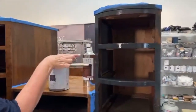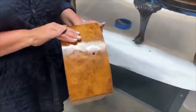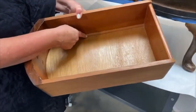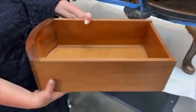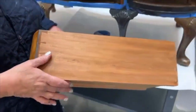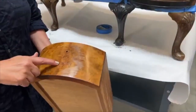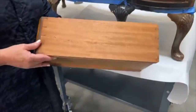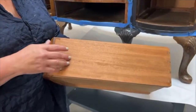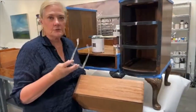Something I plan on doing — look at this. I'm going to leave my drawers like this. When you add these quarter-rounds inside a piece of furniture, this is a telltale sign that it was done by a craftsman. And I do have dovetail — this is mahogany. So I'm going to put some wood tonic on the sides and fronts of my drawers. But I'm also going to do a sweet design using one of my mesh stencils — a design that goes along with the 40s or 50s style — and then come back and do the tonic on it.